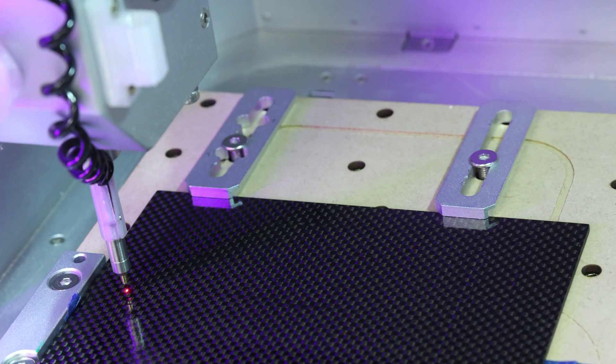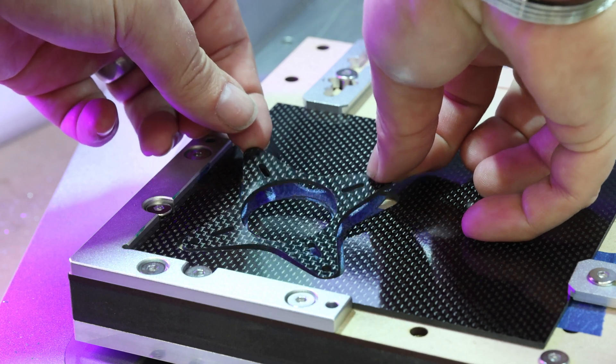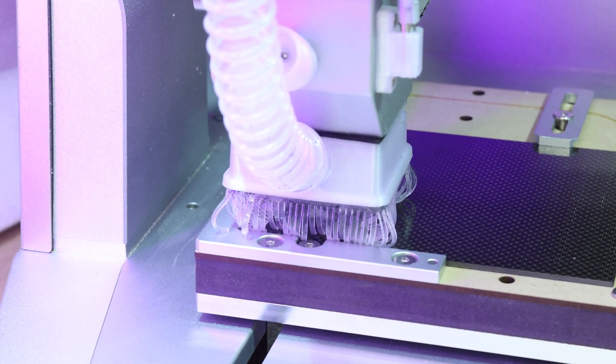That segues nicely into the next job, which was cutting a part out of carbon fibre. I have never cut carbon fibre in my life and I didn't even Google any speeds and feeds — this video really highlights just how much I wing projects sometimes — but ultimately it was a successful job and it cut the carbon fibre out really nicely. I set the thickness to cut just 0.1 millimetres deeper than the material itself, and you can see from the video on screen that it cut the carbon fibre out but hardly damaged the blue tape underneath — literally both layers of blue tape were still there, showing the precision you can expect straight out of the box. It is a dangerous material to machine though; it's usually done in a water bed, but at least if you're going to do it make sure you have a dust chute and a good vacuum set up with a filter system, because you don't want any of the particles going in the air or in your eyes.